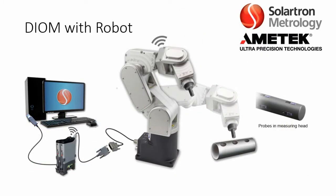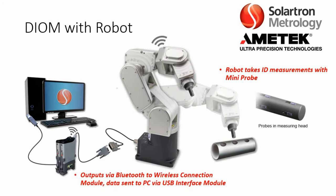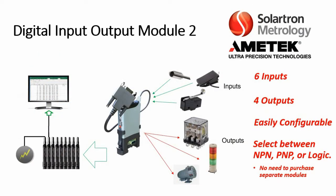Now here's a more complex application that can actually use our wireless technology. Let's say you have a robot that is using our mini probes to measure whether or not a bore is good. So a robot takes the measurement and then it sends the measurement to our Orbit stack via Bluetooth to our wireless connection module. The data is sent to the PC via the USB interface module. The software then determines whether or not the part is good. Then it can signal the robot whether to scrap the part or perhaps put it back on the automation line and further the assembly.